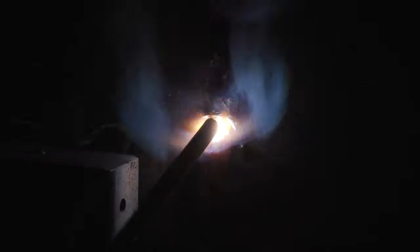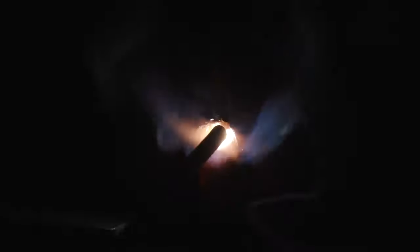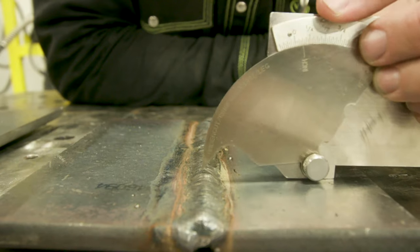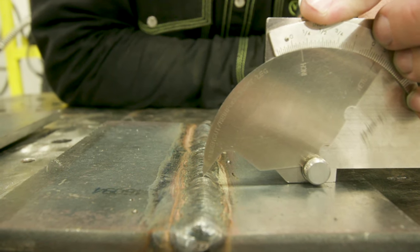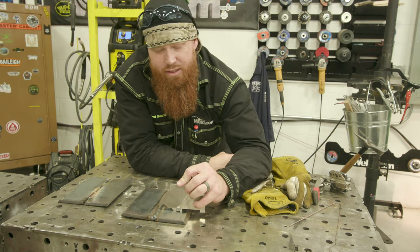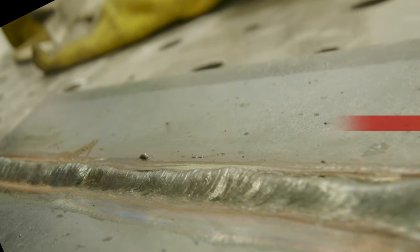Typically, if you're doing this correctly, you would hold the sides for about two seconds and go fast through the middle, because working out of position the center of the weld takes care of itself due to gravity. There's no runoff tab here, so I'm anticipating some underfill in this section and maybe some weld metal rolling back on us near the top. What we're looking at right now is excessive weld reinforcement — we're right at about five thirty-seconds to three sixteenths in some areas. I don't want to be anything higher than an eighth of an inch.